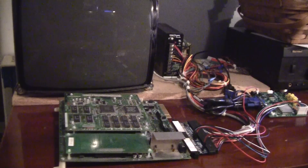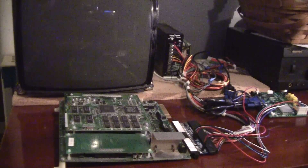Welcome everybody. Based on my previous video, I've been asked to show footage of Mortal Kombat 4 using real arcade hardware. More than one person asked how I captured it, so I figured I'd show a video so you guys can emulate what I'm doing. Basically, I'm using my standard regular JAMMA test rig and a CGA to VGA converter, sending the VGA from the converter to a video capture card on my PC.